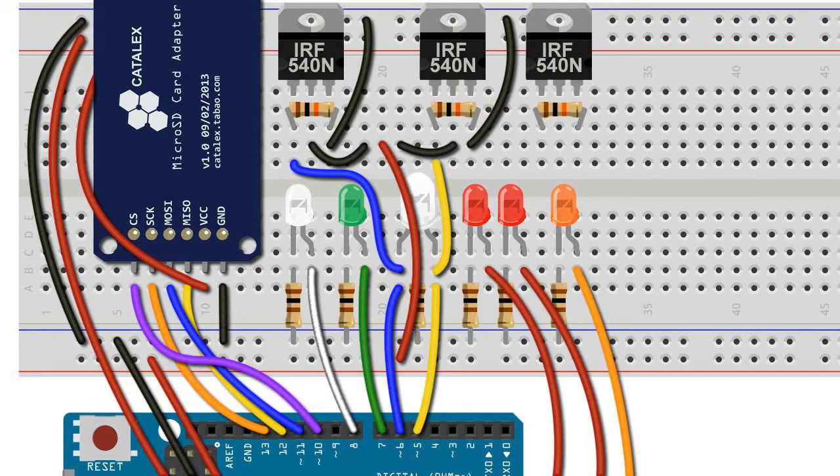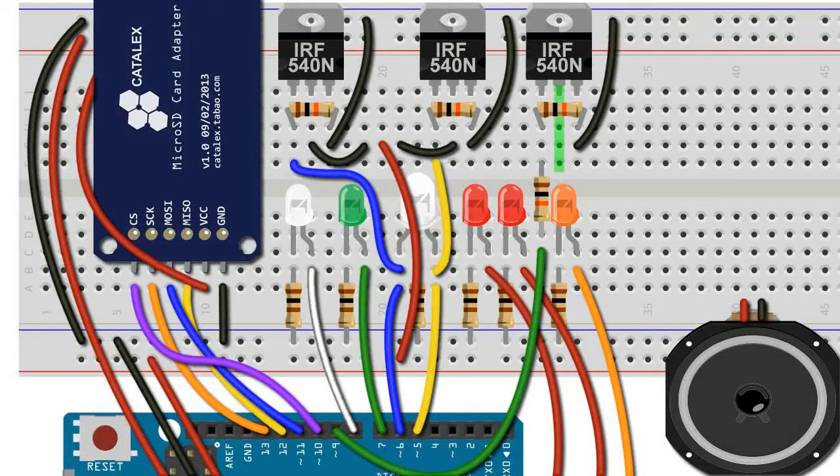We're using the final MOSFET to amplify the output to our speakers. We connect a 10K resistor to the gate leg of the MOSFET, allowing it to straddle the gutter. Arduino pin 9 gets connected to this row, and the MOSFET source pin gets connected to the negative rail. In the final step we add the speaker, connecting the negative wire to the drain leg of the MOSFET and the positive wire to the 9 or 12 volt VIN row of the breadboard.